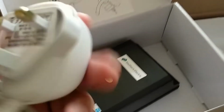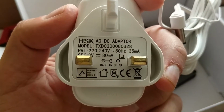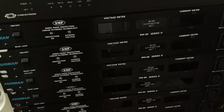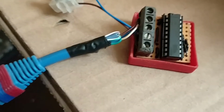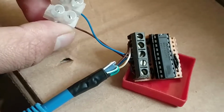And there is also a small plug for the display, which runs at 35 milliamps. I will be connecting the energy monitors to these power conditioners, so I'll need to open them up and attach the CT sensor. The display has an RJ45 socket on the back, but this is not a network port. It's actually 3.3 volt TTL signals, and in the past I've created a circuit that will use a MAX233 chip that will convert these signals and output it as serial.